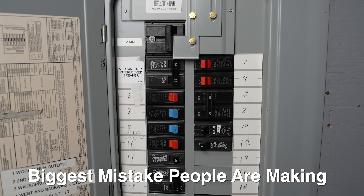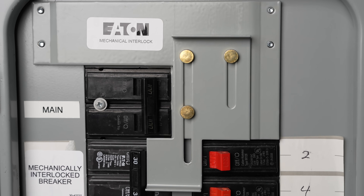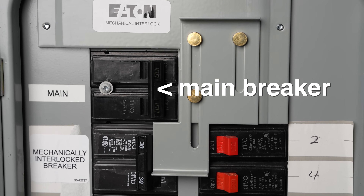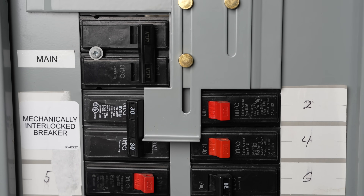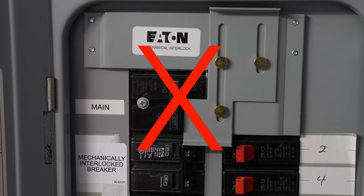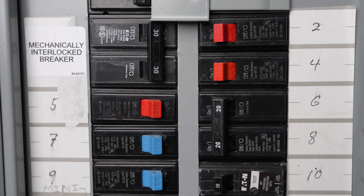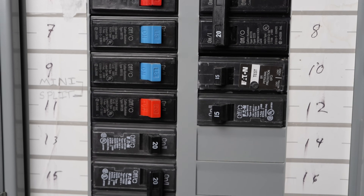Don't just go and flip your interlock breaker on. If you're not familiar with an interlock, it's a simple safety device that makes sure that your main breaker has to be in the off position before the secondary breaker that's actually connected to your generator inlet can be turned on, thus preventing any sort of illegal backfeeding from taking place. You could just flip your main breaker off right now and turn your generator on, but you would be causing a huge problem. All of the breakers in your panel are currently in their on position, and everything is still probably on.